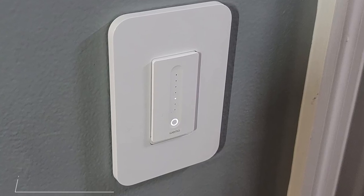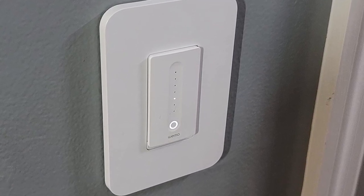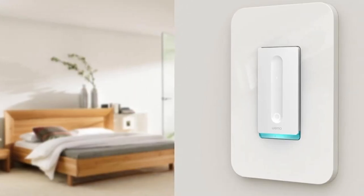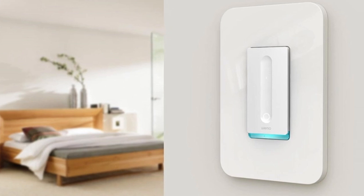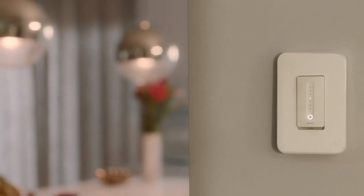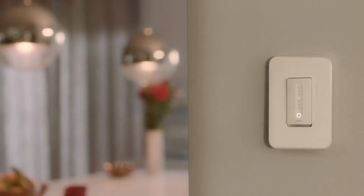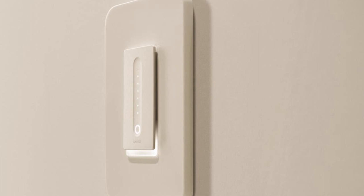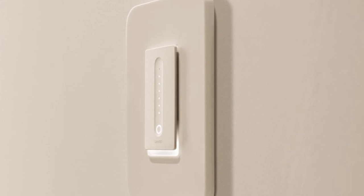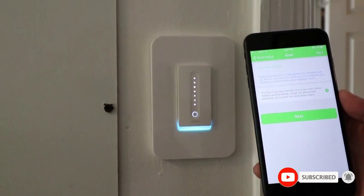The number six position is dominated by the Wemo Wi-Fi Smart Dimmer. For a sleek, modern fixture packed with functionality, you can't go wrong with the Wemo Smart Dimmer. This Wi-Fi connected switch can be controlled from anywhere using your smartphone, and it's also compatible with Amazon Alexa, Google Assistant, and Apple HomeKit. It offers useful features including night mode, which automatically uses lower brightness during certain times, and away mode, which turns lights on and off randomly to make it appear like someone is home. Keep in mind this switch requires a neutral wire, which older homes may lack.